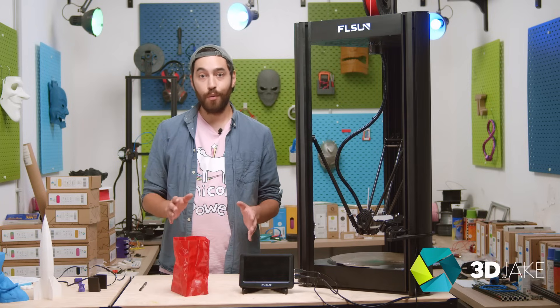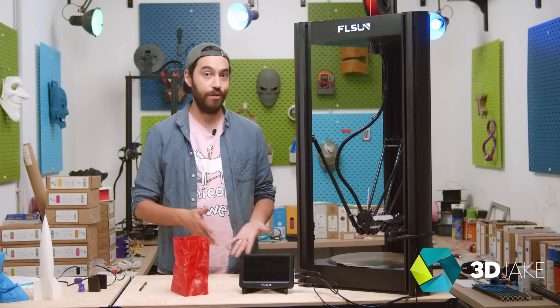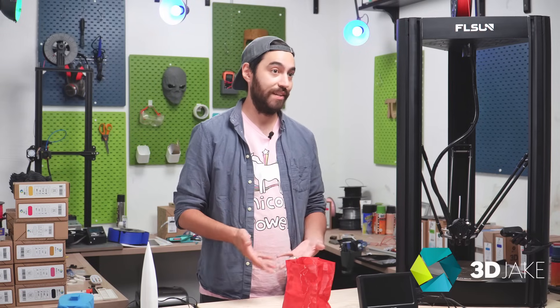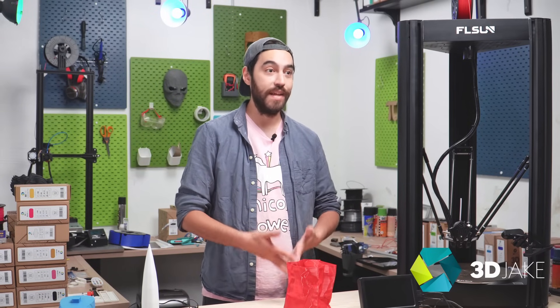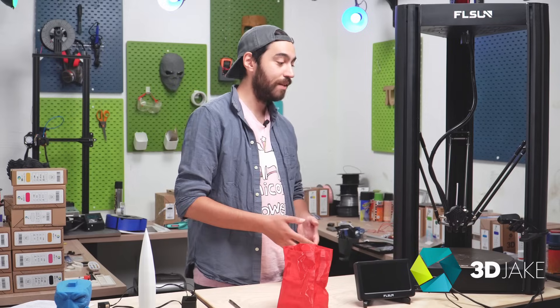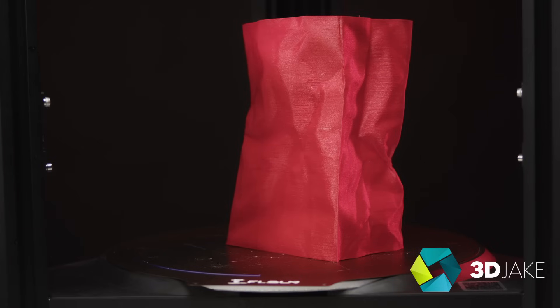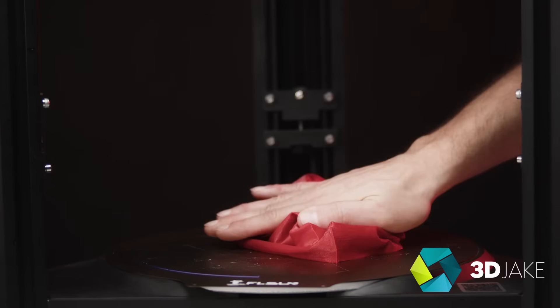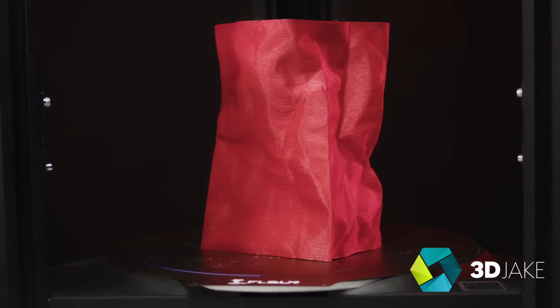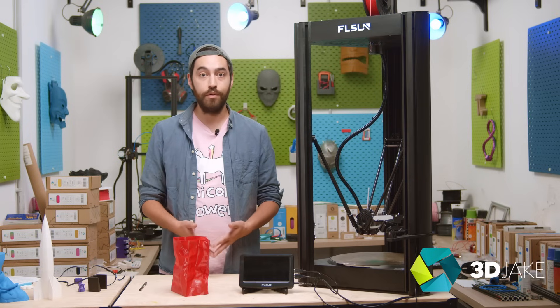There's always one thing I wanted to try with a high speed printer and that is print TPU. Coming from using Cartesians and older printers I've been used to printing TPU at 40 to 50 millimeters per second. So can a Klipper Delta printer print TPU at 300 millimeters per second? Well actually yes it can — and this is not because of Klipper but because of the dual drive gear and the volcano hotend, which make it super easy to print TPU even at 300 millimeters per second.